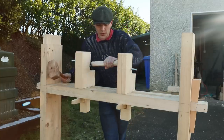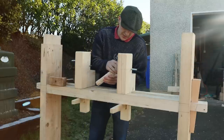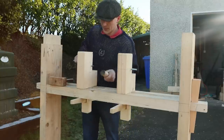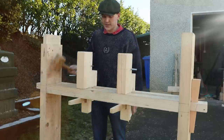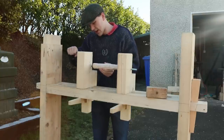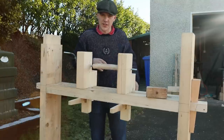So we're here now with the lathe and I want to put this thing in place. The first thing I'm going to do is use this wedge to lock this fella nice and secure in place, then bring the workpiece up to this part of the chuck and move it with my hand until it's close enough. Then I'm going to bring it back out, lock this fella into place, loosen the handle on this side a bit, bring our workpiece back up again, then twist and lock her into place. I like to go pretty tight first and then loosen it a bit, and then that should spin nice and quickly.